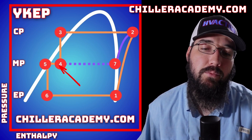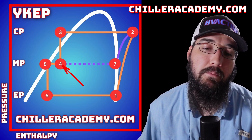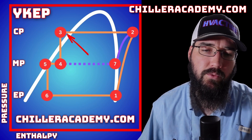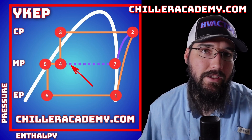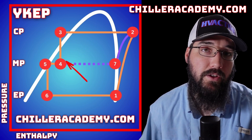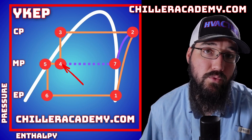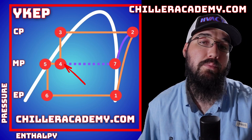From point three to point four, that is passing through the economizer — we went from a subcooled liquid refrigerant to a saturated medium pressure refrigerant. Over here we have condenser pressure, medium pressure, and evaporator pressure. If we did not have additional subcooling like some machines do, we would only hit this saturation point and then have a lot more gas to take in. Instead, because of our design, we actually reduce even further the work that the economizer compressor has to perform by letting our condenser water give us a little bit of subcooling. We flash that off, and we have less total vapor to move. Our secondary economizer compressor helps us improve our efficiency that much further.